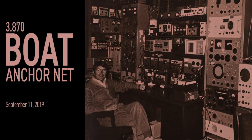Well, I've cut the mic gain way back to keep from overdriving the 30S-1, so I'm eventually going to pair this thing up with a Transworld, and I'm just waiting on an attenuator pad for the Transworld before I do that. Go ahead. Okay, you're not as loud at my house tonight as you were when you had it on the other night, and I'm thinking it was barefooted then. But that could be a variety of conditions and weather and levels of static, but all in all, it's working just fine. Over.